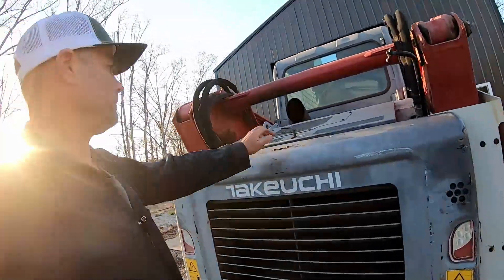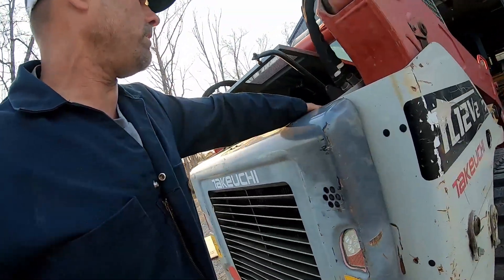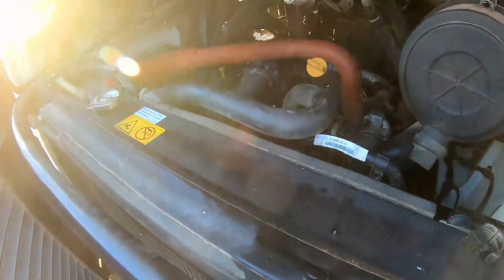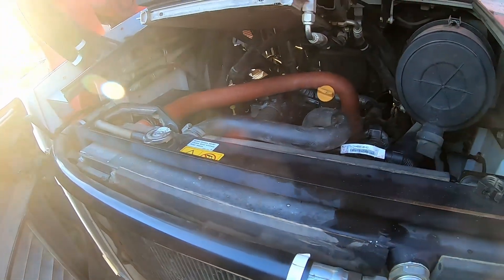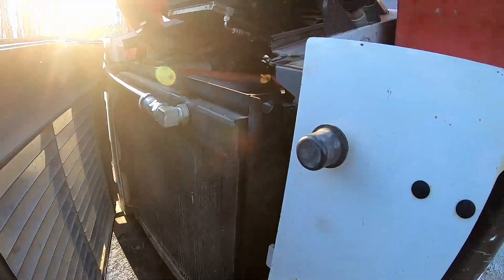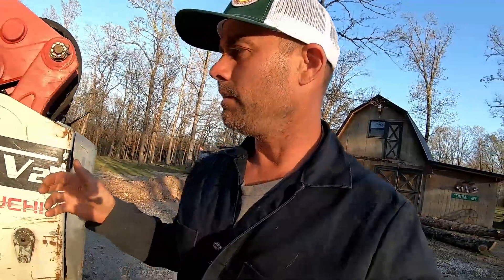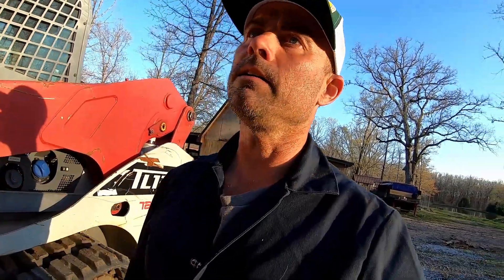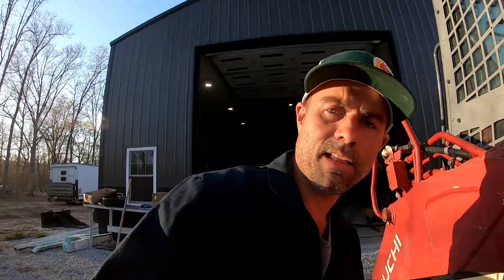Let's look at the back of the machine — we're going to lift the lid and open the door. You can see the radiator is mounted back in place, we've got our hoses mounted, and everything's kind of back together at this point. I have not filled up the radiator yet — I've got some loose ends I've got to take care of. But for any of you that have been watching this series of videos, we're kind of at a pivotal point. When I was putting the machine back together today, I had to remove the upper valve cover and the lower valve cover to get back down to the injector areas and make sure I was at top dead center for cylinder number four.